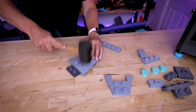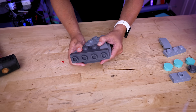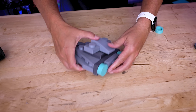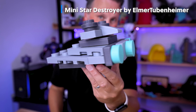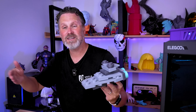Depending on the prints and how large you've scaled them up, it's going to impact how the parts fit together. The tolerances of typical Lego bricks are going to be amplified as you scale them up. My tolerances were super tight for this set of prints, which was the opposite of what I expected — I was anticipating looser connection points, since as you scale up the tolerance levels between parts in the original designs get amplified.